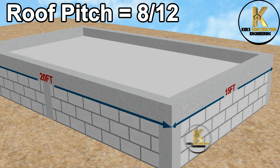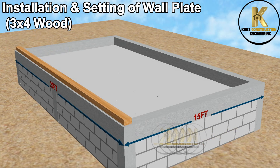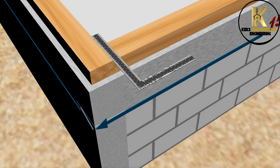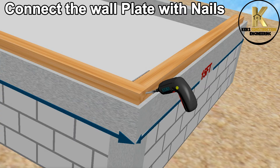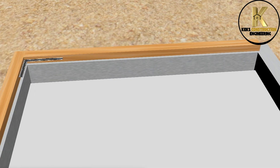Note, from the given details, we will determine the actual height of this gable roof as we proceed. Installation and setting of wall plate, 3x4 wood. Square all the corners properly. Connect the wall plate with nails. It's very important to set out the frame with the right measurement and square properly, so all your markings and cuttings will be accurate.